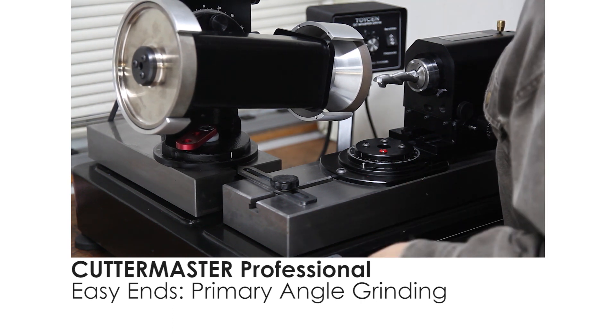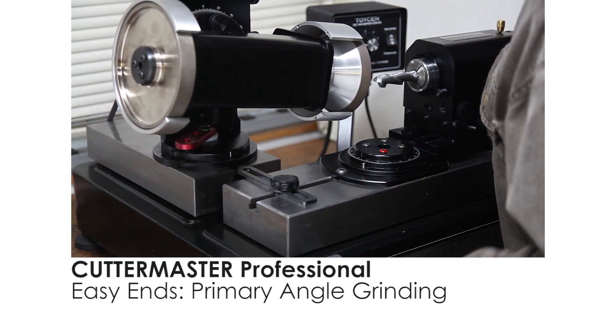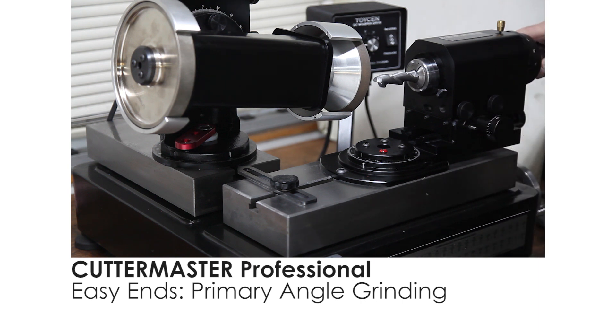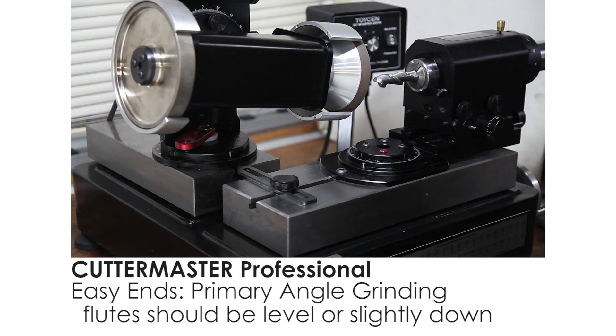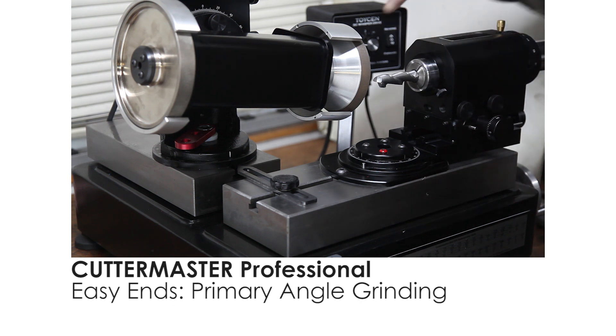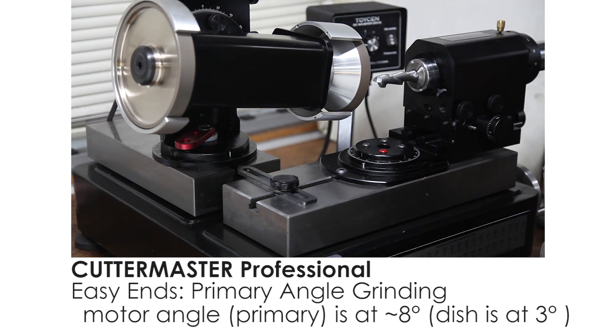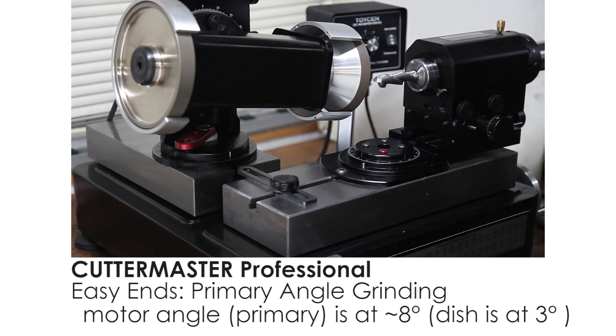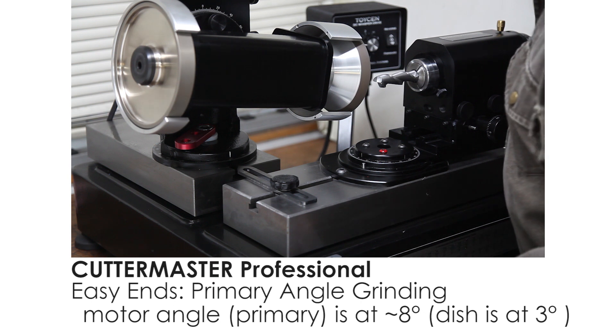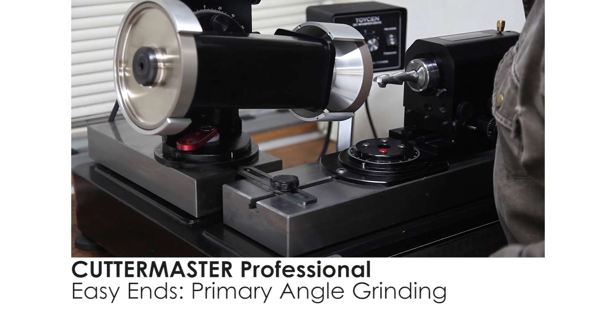Index to the next fourth flute position. You want to be level or just a little bit down — preferably level to start with. We have the motor set at about eight degrees, which is okay for a primary — a little more aggressive, which is fine.